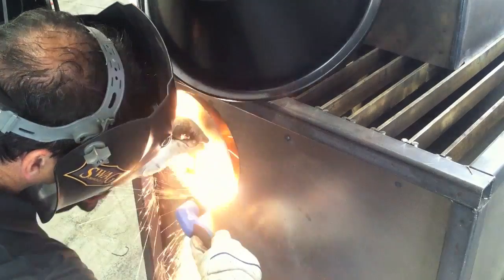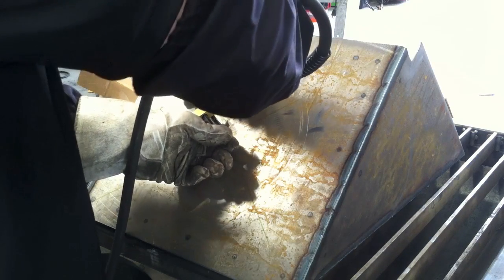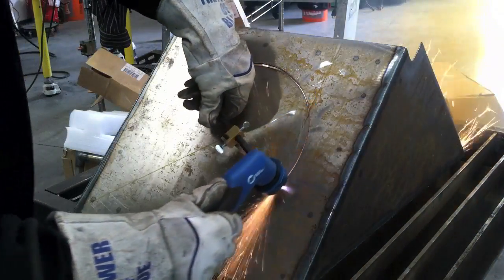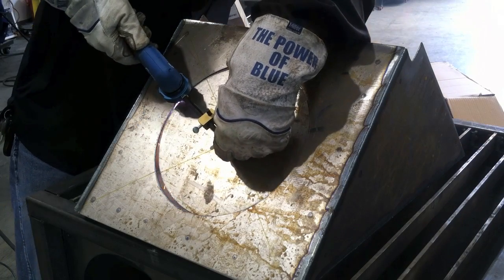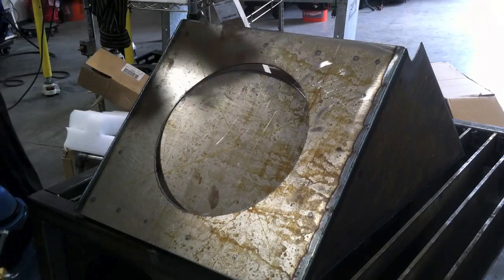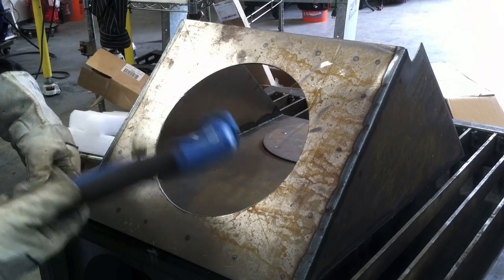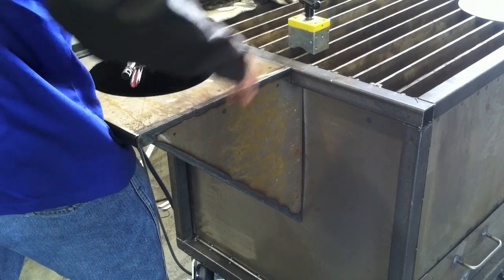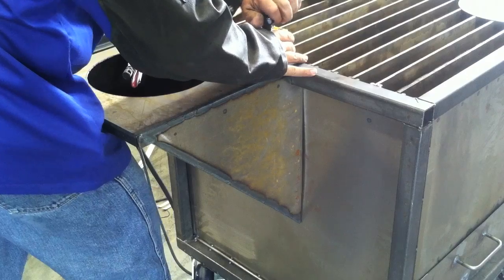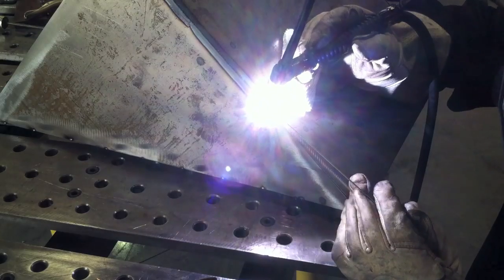Once that box is done, it's going on the corner of this little cutting table here. I'm blowing out some holes with a plasma cutter circle attachment — I'll go over that in another video coming up. It's a little attachment from Miller that works great for zipping out circles. This is a little air box that the fume extractor snorkel arm is going to go on, and it's going on the corner like that. It'll probably be a good hip-getter walking around the shop, but it's the only easy way I know to fasten the fume extractor and then unfasten it and move it to the welding table when I want to swap off.